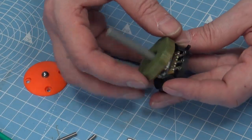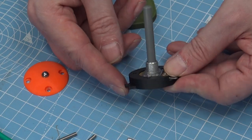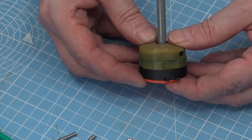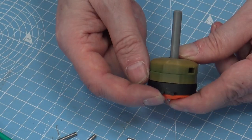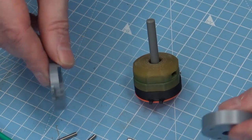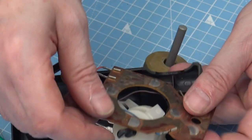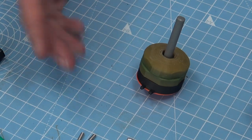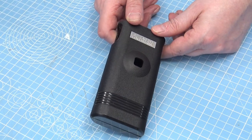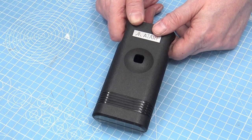But then there's this middle part that holds the potentiometer in place. So that fits in and we've got all of the modelling parts so that everything fits together nicely. That is my final design for the moment. We've got the parts that stop it from rotating at the bottom. Splitting it up allowed me to develop the parts individually without printing everything over and over. But it does mean that we can't copy our original design where it pushes down on the switches, so that meant we had to go to micro switches.